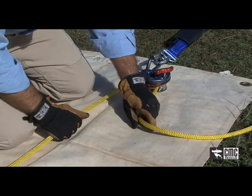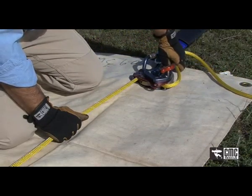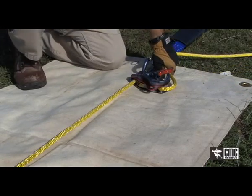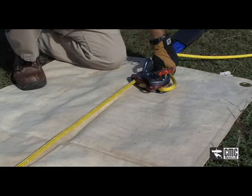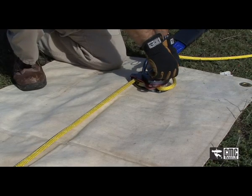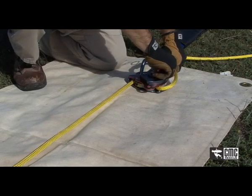Once the edge transition has been completed, I want to run this as a tension belay. I bring the tail of the rope back to operate it as a tension belay — it's operated the same as a lowering system. Use my thumb to push down on the body, raise the handle up and turn it in the direction of the arrow.